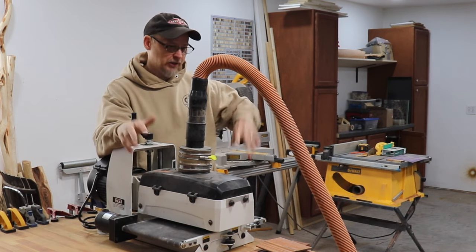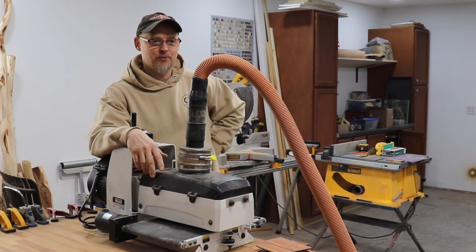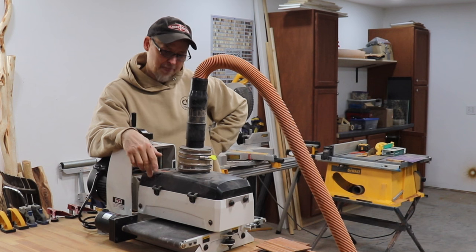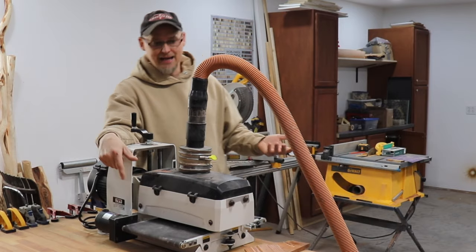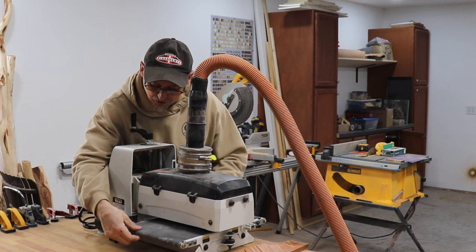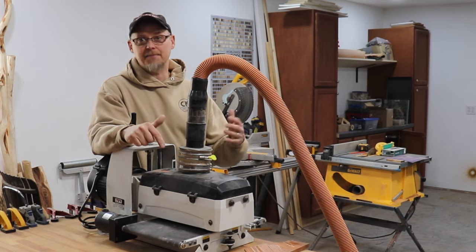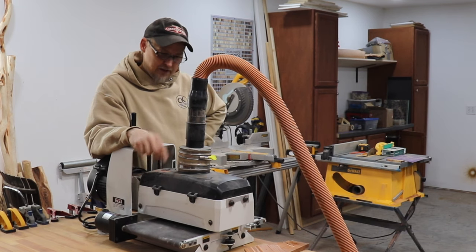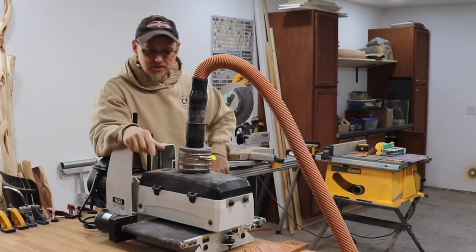We shut it off, put it on the bench, called it good, and hadn't used it since. Months later I go to pull it out and use it — literally just reassembled, ran some small two-by-fours through it, everything seemed good. Put it away. Now I pull it out for these trim pieces and I'm not even through two pieces before it starts pausing again. The belt pauses, the shaft won't spin consistently, and if material stops mid-pass inside you get a groove or a cupped spot sanded into it — you definitely don't want that.